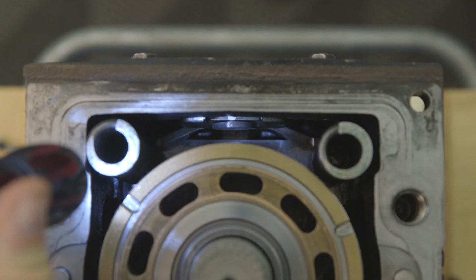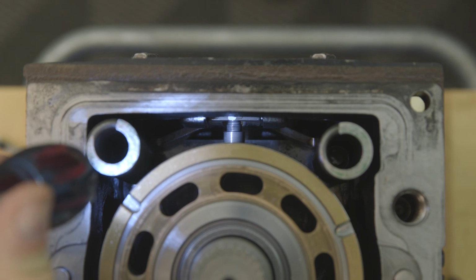If the tool is not properly installed when the seal nut is removed, the guide post nearest the drain port may fall into the pump. However, the guide post cannot completely drop into the pump. Simply find a magnet and pull the threads back through the outside of the side cover.